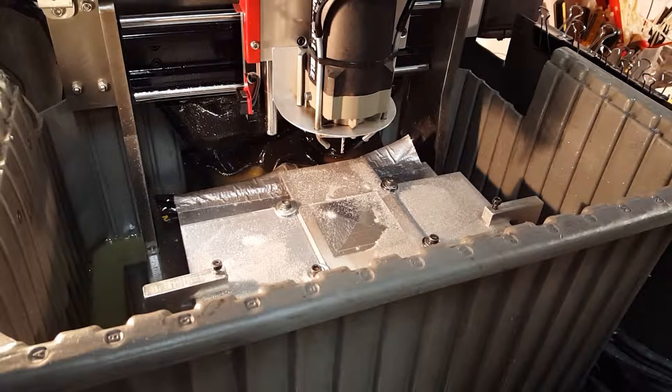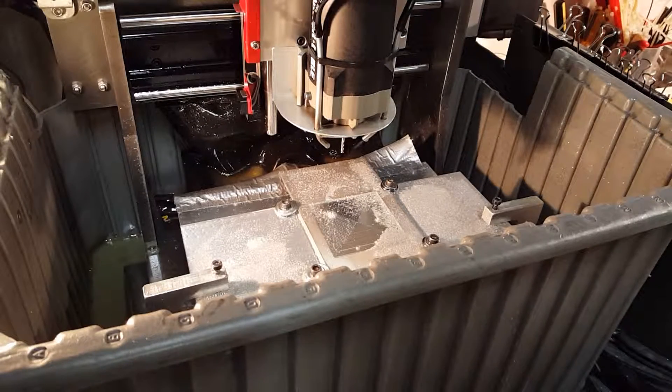With the new flood cooling system, it couldn't have run better — I'm very pleased. I was running into trouble, as you've probably seen on other YouTube videos, where people use a can of WD-40 or similar to coax chips out of the way of the cutter and provide lubricant. I had done the same, as you've probably seen in my other videos, but I got tired of that quickly and wanted flood coolant, so I put my own thing together.